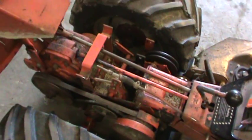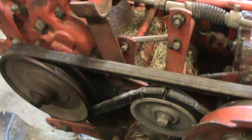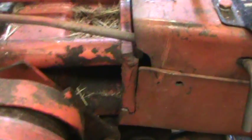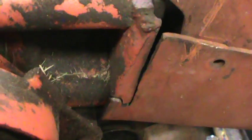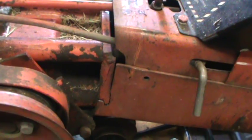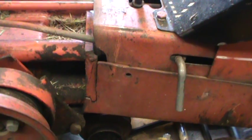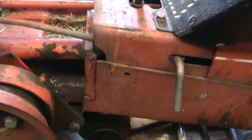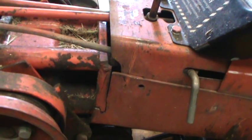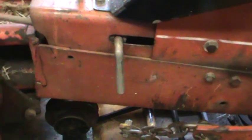Let's get into the nitty gritty and see what exactly is going on here. The transmission looks all right — it's actually got an old original Simplicity belt on it that's about had it. Anybody see what the problem is? The frame is cracked from the backing plate, and just on this side. This was a weak link with these tractors and it is a known problem. They did fix it after a couple years, realizing this was a weak link. What they did was extended the frame and welded the mounting plate that mounts to the bevel gearbox deeper into the frame, instead of all the way out at the outer edge, which cured this splitting problem.